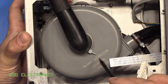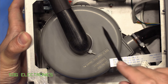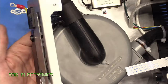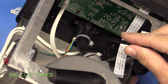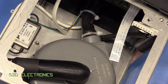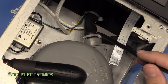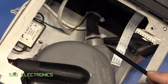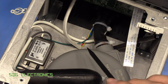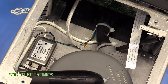Everything looks okay on here — certainly no problems with the construction, and we've got isolation where we need it — so this looks to be quite a decent design. It's just a shame that they've linked out the fuse here that goes to that transformer. Inside the unit we've got the massive blower — now we can understand why the switch mode power supply was so large — it's a 24-volt DC motor at 2.85 amps, which is getting on for 70 watts just for the blower. It also needs a 5-volt DC supply, presumably for the hall effect sensors for commutation. There is no pressure sensor or anything like that, so either they are monitoring the current from the blower and compensating for the restriction on the output, or they're simply relying on the sheer size of this blower and its static pressure to overcome the resistance of the nozzles — which is probably what they're doing based on what I'm seeing here.